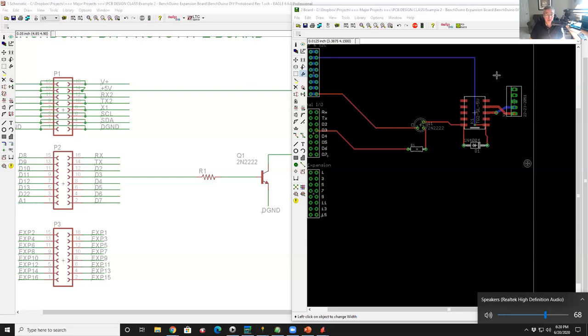You want UART support, because we do a lot of stuff with UARTs and ham radio gear. So the Arduino Mega happened to have four UARTs, and so I reserved four UARTs because I do a lot of projects with a lot of UARTs, so that was a little UART rich. I didn't feel the need to do two I2C pairs because one is sufficient, even though some of the processors have multiples. The next logical thing is ADCs, so analog to digital converters. The Mega has like 16 or 20 or something like that. So I reserved so many pins for ADCs, and a couple pins for PWMs.